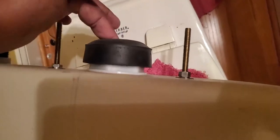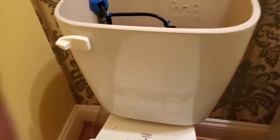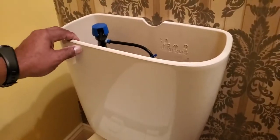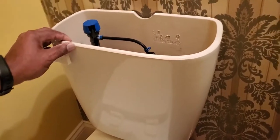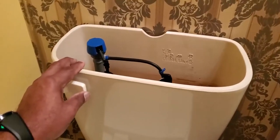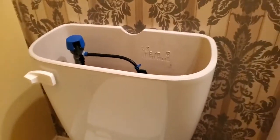Make sure that seal is seated right — there's no water coming out of here, the water comes out of here. Sit it in place. Now move it around — see how it's steady? You're not hearing porcelain on porcelain because it's sitting on the seal now. Those bolts on the bottom aren't supposed to be super tight; all they need to do is keep it in place.